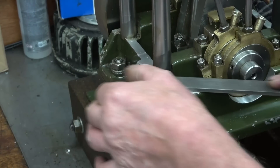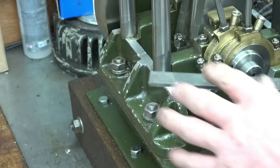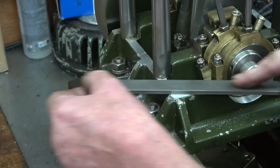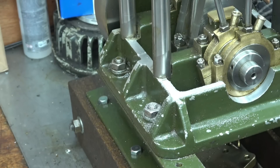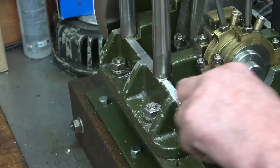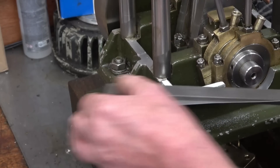I've got to take the metal off there quite nicely. With practice you can file nice and square and level. The file only cuts on the forward stroke, so you don't just push back and forth - you release the downward pressure when you come back. It's soft aluminium so it is filing quite easily. Wrapping emery tape around the file is often a good way of getting a better or finer result, to take the file marks out.